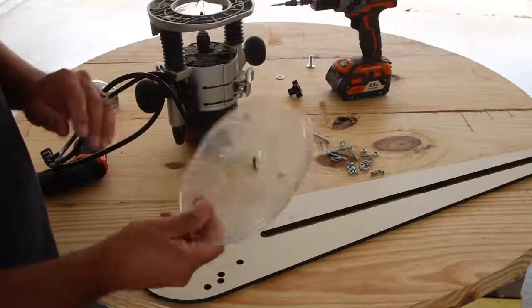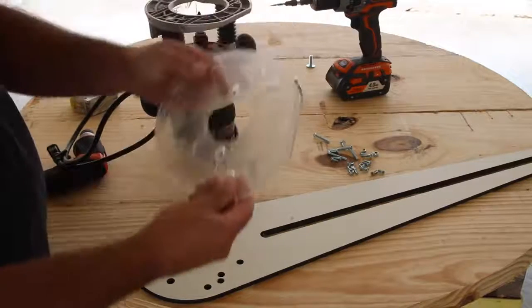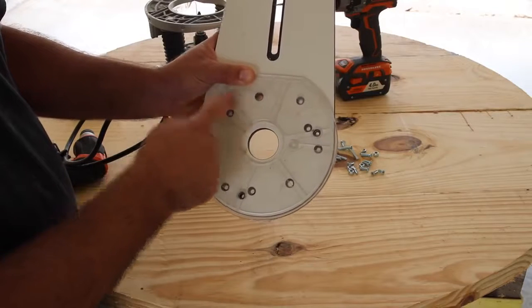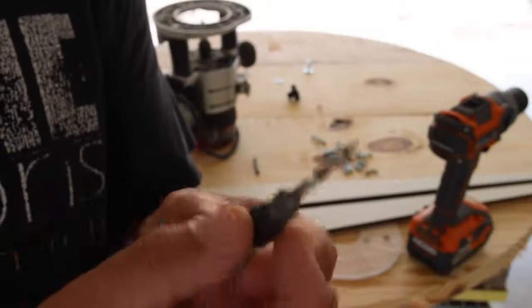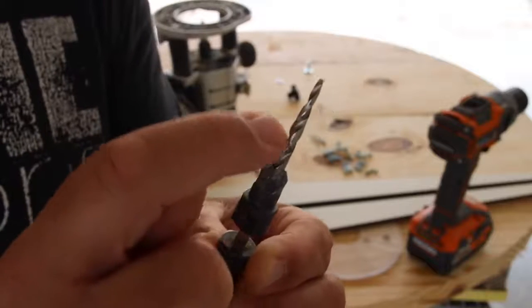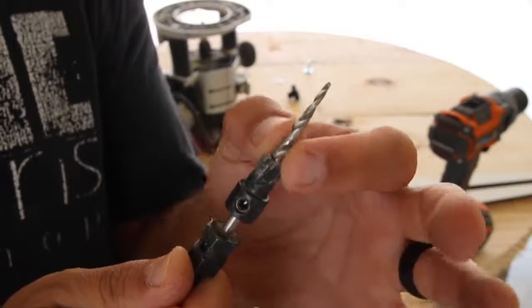The way I went about this was I took the little clear plate off of the router — most routers have these, held on with three screws. I marked them with a sharpie so I knew which ones they were, lined it up with the center hole on the jig, marked the jig with a pencil, and then drilled the holes. The drill bit has an adjustable countersink collar held on with a couple of allen screws so you can adjust the depth. I used the thicker part of that drill bit for the screws that hold the router on.